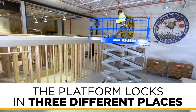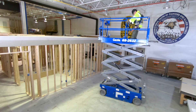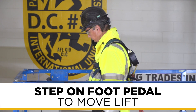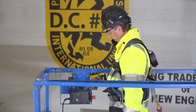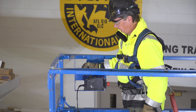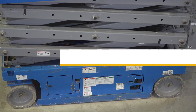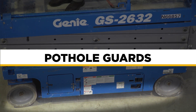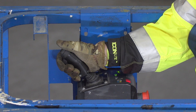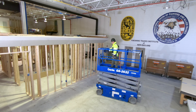The platform locks in three different places. To move the scissor lift, you need to step on the foot pedal. When you turn the machine on, the default setting is the drive mode — you'll have to switch the controls to raise or lower the platform. As you lower the machine, visually check the area again. Here you can see the pothole guards under the machine; they come out every time the lift goes up to help stabilize the working platform. When they're elevated, most scissor lifts can't be driven at full speed. Some models can't be driven at all after the lift has been elevated.